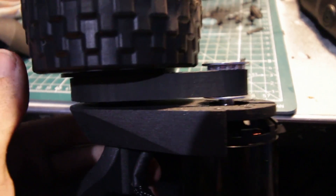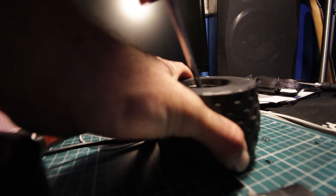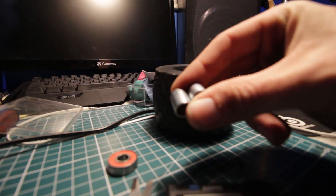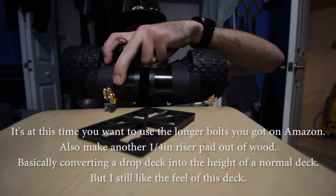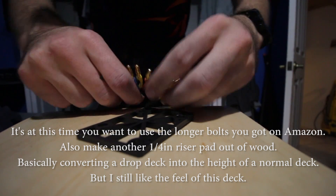And now the moment of truth — that couldn't be more perfect. So we don't actually need the inside bearing since the lipped bearing is taking all the weight. Go ahead and stick your screwdriver in, spin it around a bit, and a bearing pops out. The spacer that comes with the DIY e-board is much longer — you want to use the long spacer when you install it. Just do the same thing on the other side, and here we are mounting it up with two bolts for testing purposes.